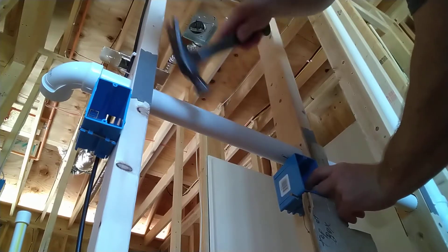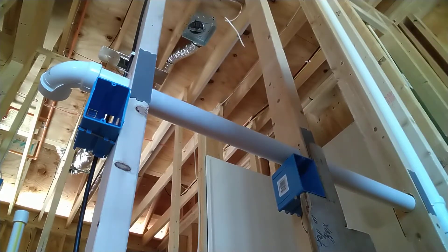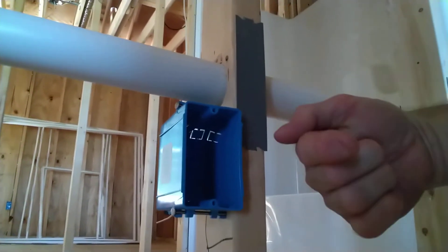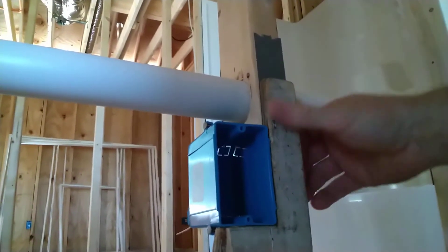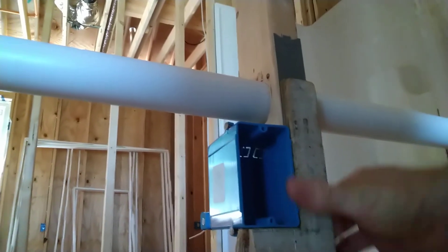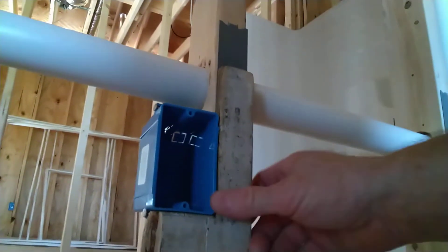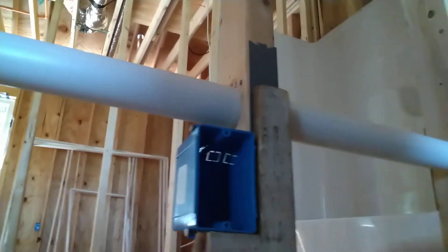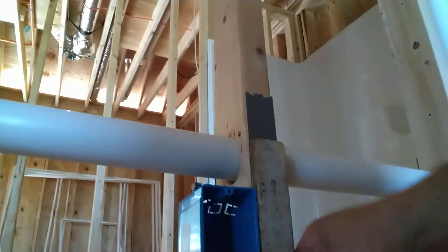Set your nails and drop them home. The plumbers have already put a nail plate on, which is going to make the sheetrock out a little further — approximately a sixteenth of an inch. Placing this cheater stick on top is going to give you a nice flush line so when you put your sheetrock on, your box is going to be flush with the surface, which is code compliant. If it's off just a slight bit at the bottom, you can hit the bottom corner in and get it back flush, as long as it's no more than a sixteenth.